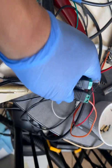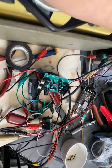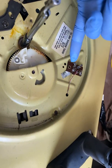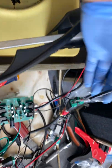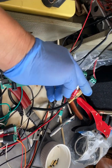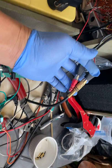And so they share a common negative, and there's that common negative going to both of them. And then that's that. So now we have RCAs, and we plug it into this area because this is the out. The RCA that's coming in is going to come from the record player. So this is the record player's RCAs. This is coming out from the record player, which is the same wires that's over here. And then we tap those wires. We cut the connector here, and these wires are tapped into these RCA plugs, and this is going to be our RCA output going into this thing. So I might connect this so it can become 2, so I can have another set of RCA out in case I want to go to a home amplifier to bump it up even higher.